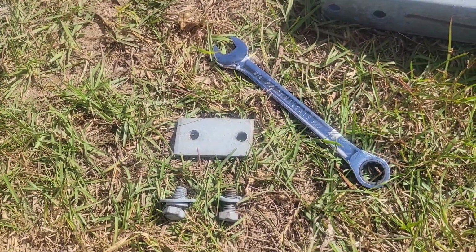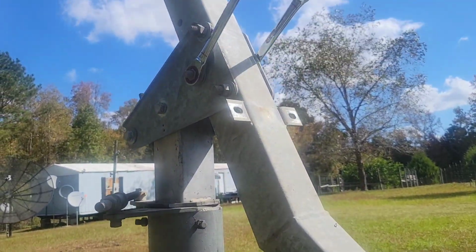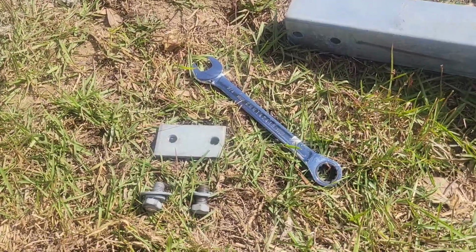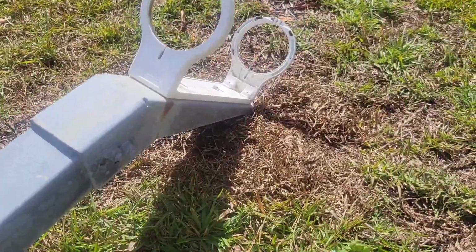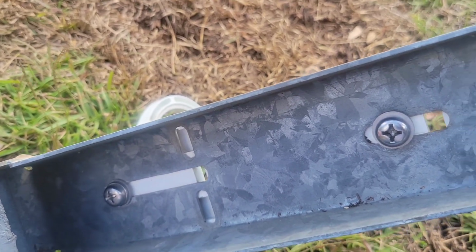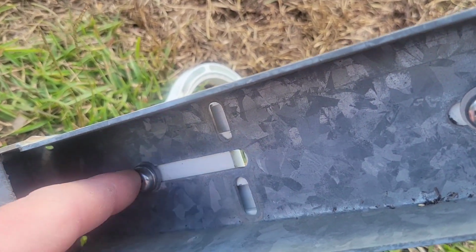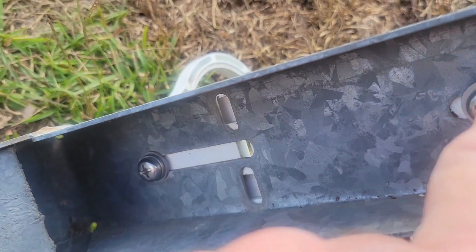It took me a while to figure it out. So that's a tip. When you take these commercial dishes down, lots of times everything's machined to fit. And if you get your screws and bolts mixed up, you're gonna have a time. I had a time with this because this thing here was machined in there, and man, I just had to keep backing it out. It would never go in, and I had the wrong screw, because this screw went here and this one went here, and they're the same, but the threads are a little bit different. I don't know, maybe sitting up for a while, maybe there's crud in the threads or whatever, but I had to just keep working with it till I found the right one that would fit. And when I finally got it lined up, I did this here and finally got it to go in. Hopefully it didn't cross thread, but everything is machined on these things.